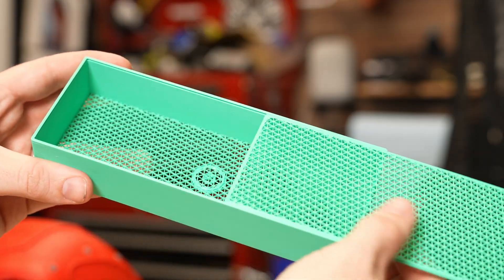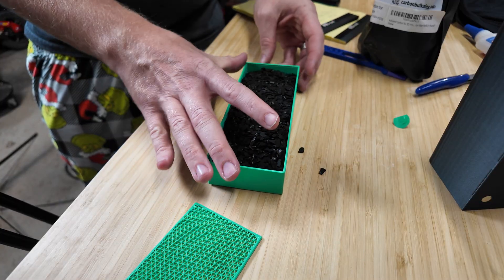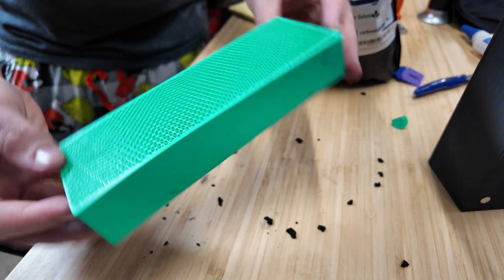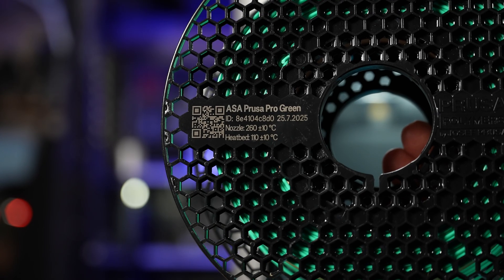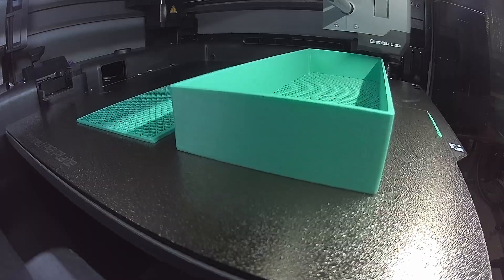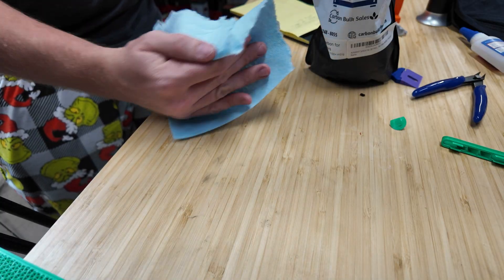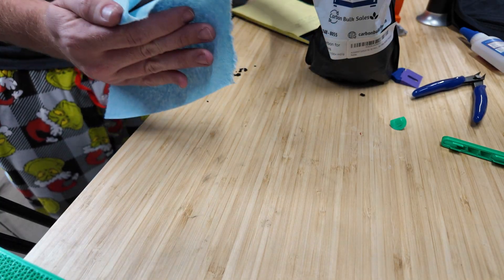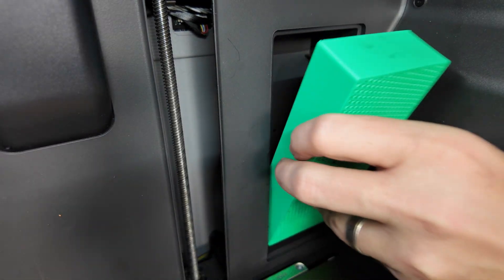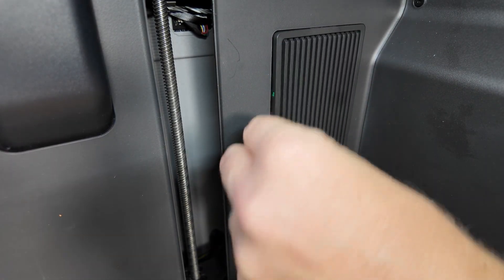It's a simple design with a sliding lid that lets you fill it with activated carbon. Be careful here because you're going to get this stuff everywhere if you're not careful. The activated carbon should help reduce plastic smells if you're printing with the front door closed. I printed mine in Prusament's ASA since this area can see some higher temperatures. Filling it was a bit messier than expected — definitely don't overfill it, unless you enjoy vacuuming your workspace and cleaning up with isopropyl alcohol. Once it's ready, swapping it with the stock filter is super easy. I'd save this file for later and wait for your built-in filter to need replacement, just so we don't have any extra waste.